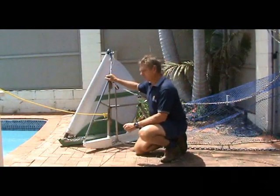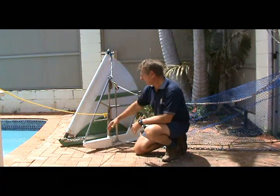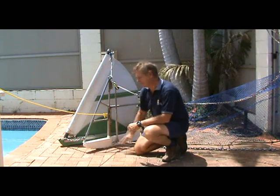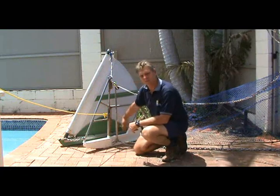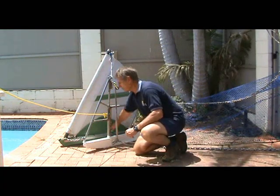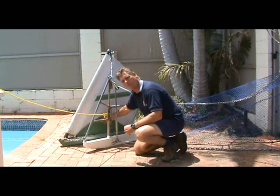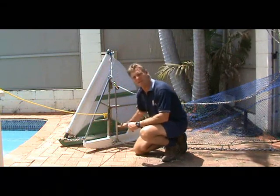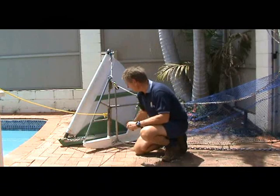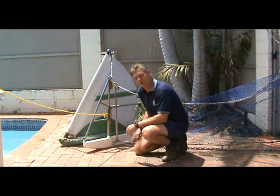In order to help shooting away, I've moved the heavy shoe into the direction of tow like this. This makes the otter board a lot more friendly to the seabed. There's no scraping of the contact shoe on the seabed — it slides in the foil direction, or in the direction of tow, like a sled. The bottom of the foil has got a rubber flap. The high pressure on the front side of the foil forces water to flow underneath the otter board, so the foil is actually floating on a cushion of high pressure water, supporting the foil underneath the rubber flap on the bottom.